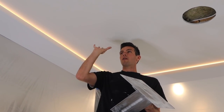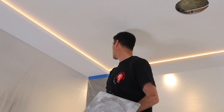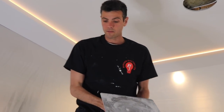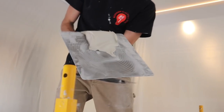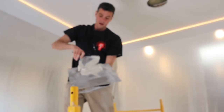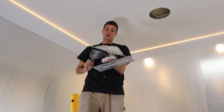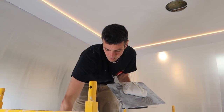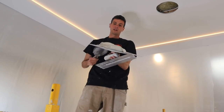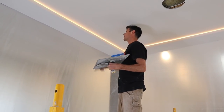If there were some voids that I missed because of going that way, then they tend to get filled in going the opposite direction. And I also have my mud mixed considerably thinner, so it's definitely filling in, closing in after you take a scoop. You can see it dripping there. It's not super runny, otherwise it makes a mess, but it is still pretty thin. So it is now time to do the second coat.